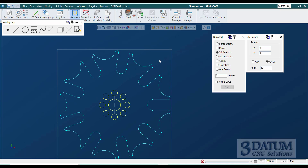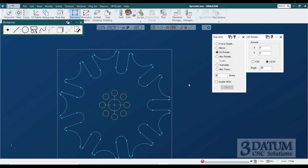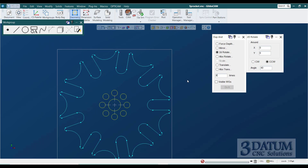I'd like you all to draw this part — we need it for tool path creation tomorrow. Make sure you get your center bore and your bolt circle holes. Then draw the outside shape. Before you do your final rotation, it needs to look exactly like this: yellow terminator square, then everything blue to the next yellow square. When you rotate 40 degrees counterclockwise, that point should end up exactly on top of the other point. Go ahead and work on yours.